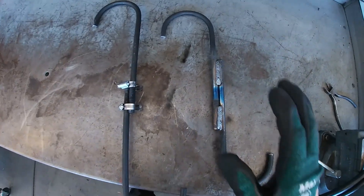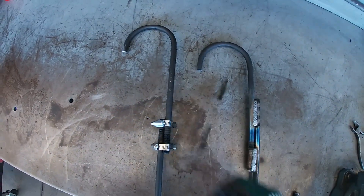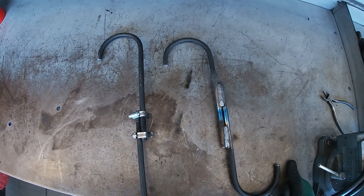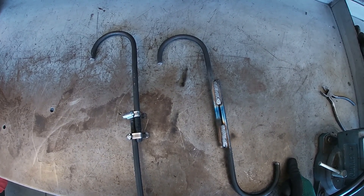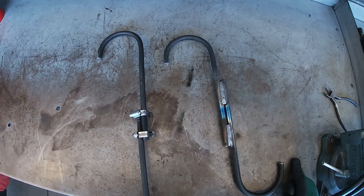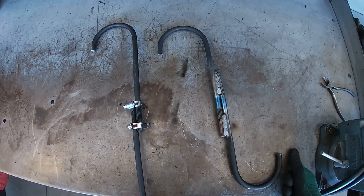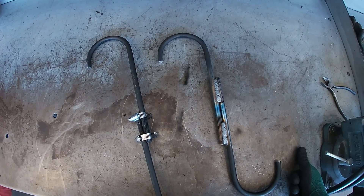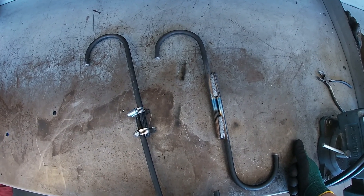All that's really left is waiting for the welded one to cool down and put a little bit of paint on it. You should put paint on the ends of the ones you didn't weld too, if you went that route. Pardon my welding skills — I'm not a professional welder, just basically a mechanic that welds when need be. I hope you found this helpful. I just wanted to show you how to make a really quick, inexpensive tool, save you some money, and make use of something that would normally be thrown away. U-bolts typically get thrown away right after use since they're one-time use — they stretch when used. Hopefully you found this helpful and we'll see you in the next video.